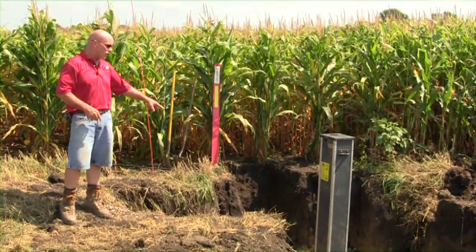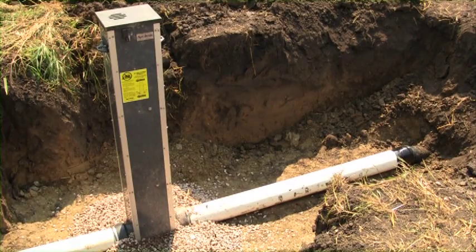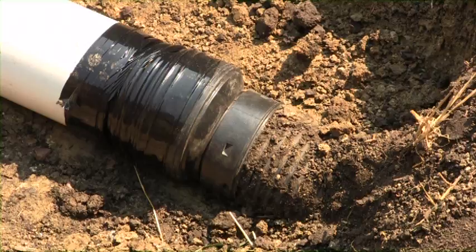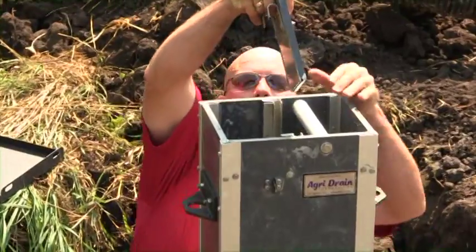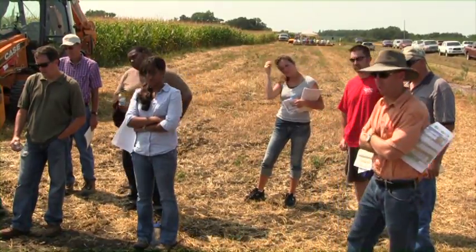This is a 6-inch structure. We put 6-inch PVC on each side. For the first part of it, you want to use non-perforated so that the water doesn't try and bypass. We use a rock base underneath just to help stabilize it, and then we will backfill it up to grade and put a marker by it so that it doesn't get hit. After we get the harvest off, we'll put the stop logs in and we'll probably hold it within two feet of the surface all through winter. Then about a week and a half, two weeks before we think we're going to plant, I will pull the stop logs and let the profile drain out. Then we'll be able to work the soil, plant it, and then we'll put the stop logs back in.